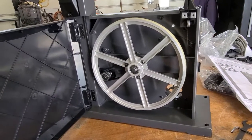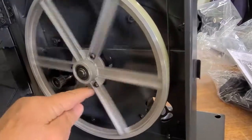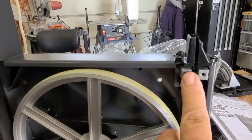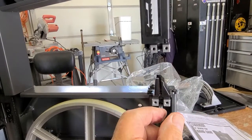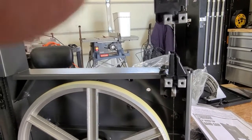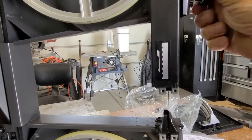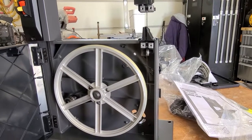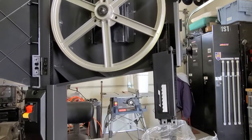I think I've done the setup. The belt seems to be running true and centered like it should. The only thing I had to do is adjust the guides — both the top and bottom. You don't want them touching; you really don't want them rubbing, but just as close as you can without rubbing. It's ready to go. I'm going to put the table on — this will adjust up and down pretty nicely. The blade was off, so I put it on.